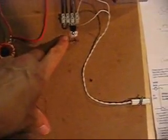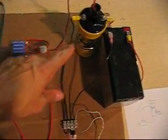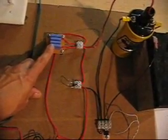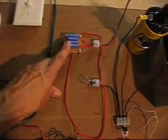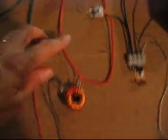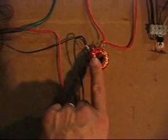It's basically a TIP42 transistor reed switch and it's firing the coil over here. The coil goes into these high voltage capacitors at 2500 volts each — I believe they are .003 microfarads each. They're hooked in series and it dumps across this spark gap, and that triggers this coil that I got from a PC power supply. It's got multiple taps — I'll show you in pictures later.